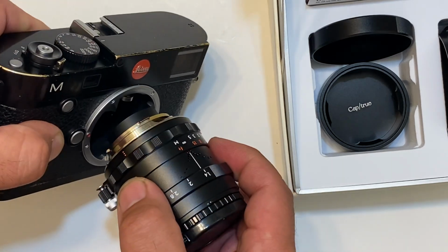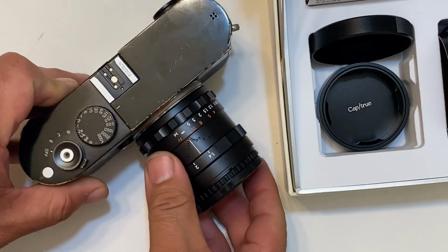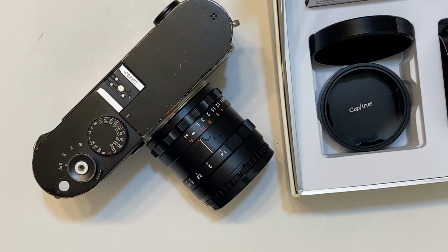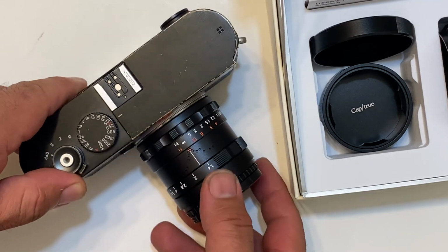That means the manufacturer really tried to calibrate the lens properly. They didn't just slap a lens mount on the back of the lens. They actually looked, and some of those shim pieces are 0.02 millimeter, probably, and some are 0.2 millimeter. Very, very thin, almost paper thin, a little bit thicker than paper, but metal shims that went underneath this mounting ring. So it's kind of cool, kind of neat.